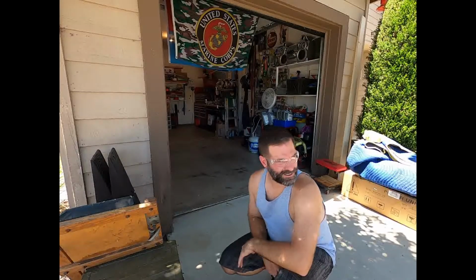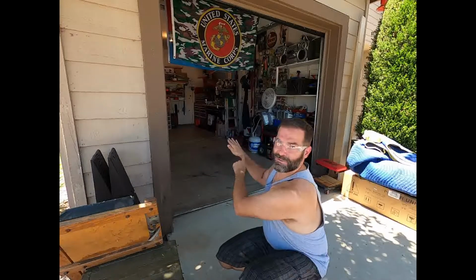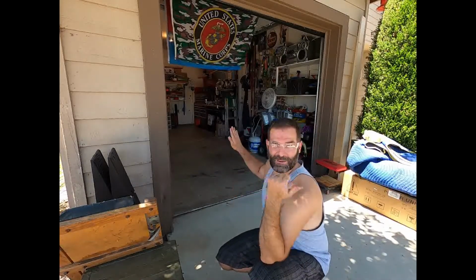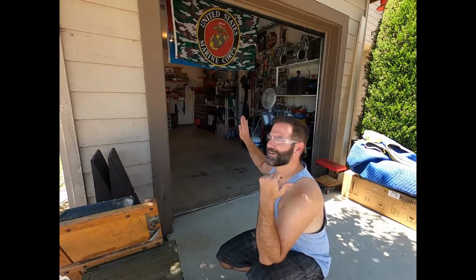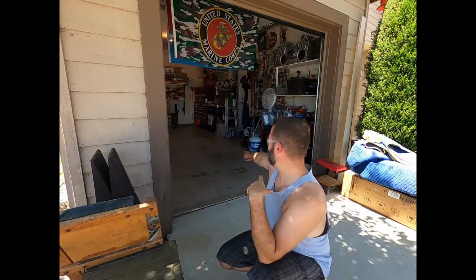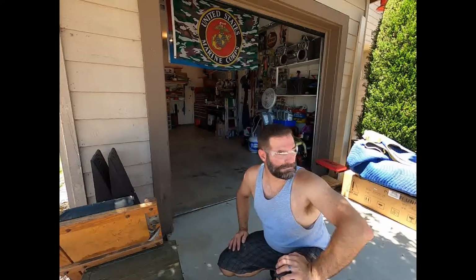It's a 4x4 in the wall that I drilled into, and I'm gonna use that with a strap to try and keep the bottom of the pillar, it'll be this way, as I use the cherry picker to lift up the top, and then maybe even the truck to pull the column upright. That'll be a sketchy part, but hopefully that 4x4 will at least hold the bottom so it doesn't slip on the semi-polished concrete. It's pretty smooth, and so yeah, we'll see.